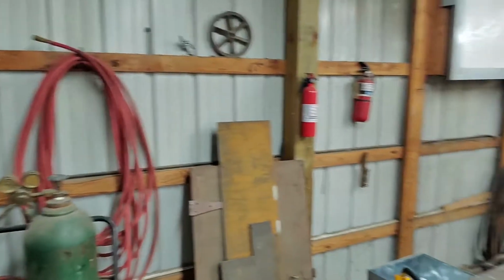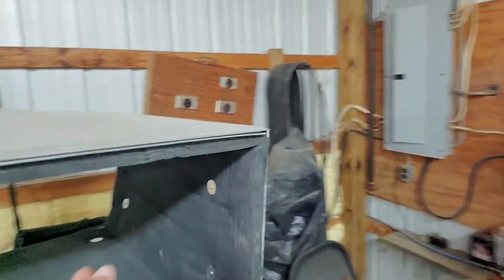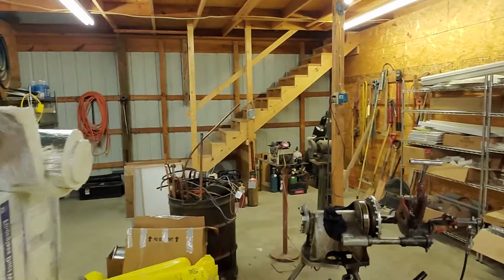This is a pin spotter, all right? Durodyne pin spotter. All right, so this right here is the spot pin, and that's how you get the insulation, the liner, to stay on the duct. See it welds right there into the metal. After you spot pin your insulation on your ductwork, that's your final step. Your ductwork has come together. It's probably looking great. Let's look at some other things inside of the sheet metal shop that we use here.